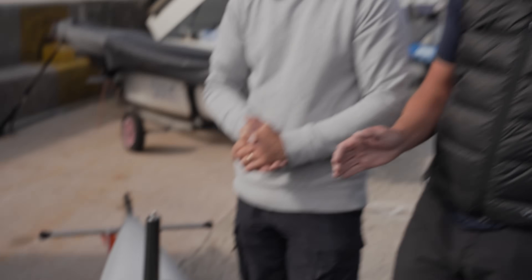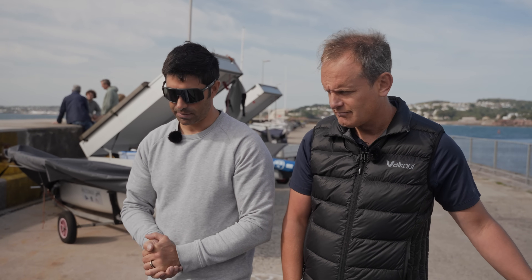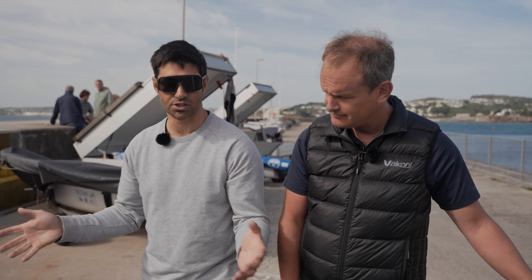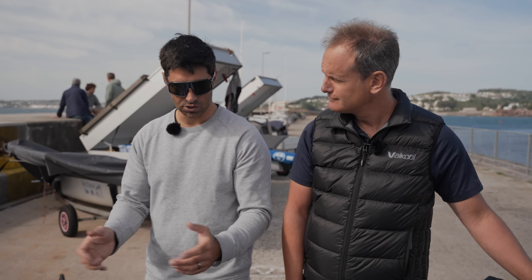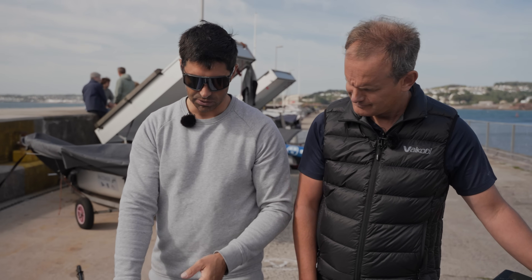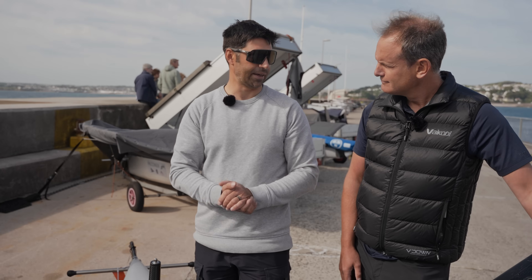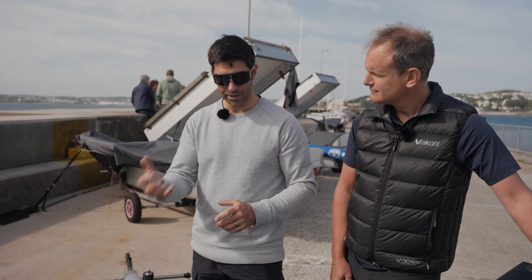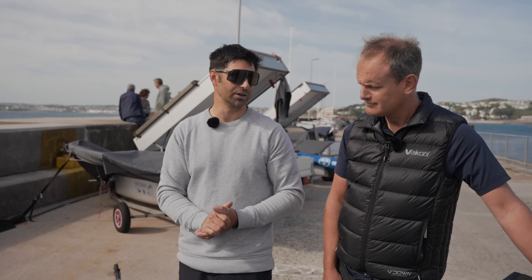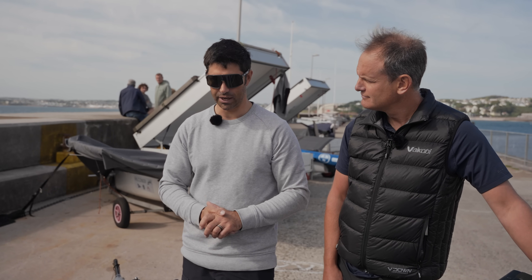When you're sailing, there isn't actually a single rope flailing with a tail out the back of the boat — it's all taken up. Yes, it's all taken up, and one of the things that has become a little bit more difficult as a result is you can't see any of the systems. So if anything stops working or you need reference on where things are, you don't have that now. That's one of the reasons the Cyclops load sensor is so useful — it can give you a live Vang load the whole time. When you're trying to repeat settings, if it rains and you get your telltales wet or you've capsized just before the start, it's hard to get a good read on your rig. Just knowing some numbers you can use as go-to settings really helps you find the groove again.